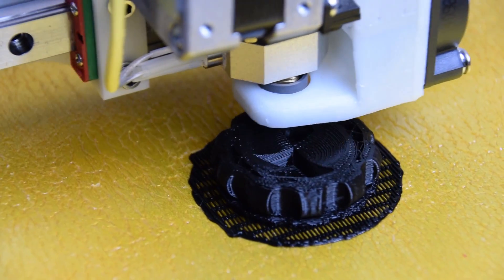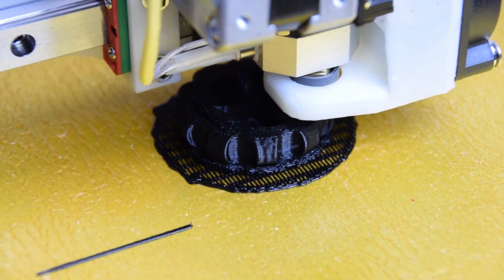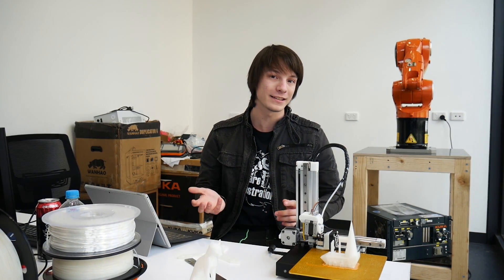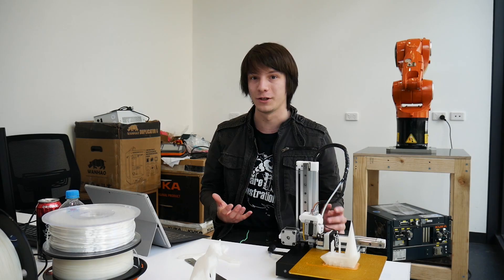The first test with the 3D Printing Systems house brand PLA worked beautifully, though I've since lost those prints after moving to this new studio. The subsequent prints with the PolyAlchemy Elixir did start working but then started clicking. The printhead would work for a while and then start clicking and failing. I moved on to the Hobby King PLA, which had the same issue — in fact, it had an even worse time, clicking and jamming almost straight away.